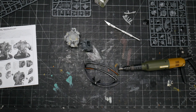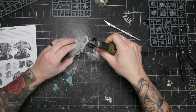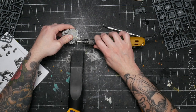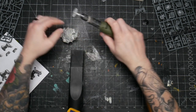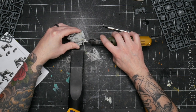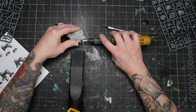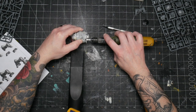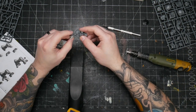The model I wanted to steal from was cast in resin. This meant it was very difficult to cut, and not only difficult but fairly dangerous. You need to use a rotary tool if you plan on making the cuts in any reasonable amount of time, but this creates a big mess of harmful dust and you don't want to be breathing that stuff in. It's important to take precautions: mask, glasses, and dust extraction. I use a shop vac right by where I'm cutting to remove the majority of dust before it gets into the air, and I also have an intake connected to my shop's extraction fan to remove anything else floating around. The point is resin sucks to cut up and work with, and it wouldn't be my first choice if I had multiple options.